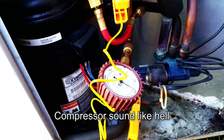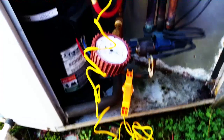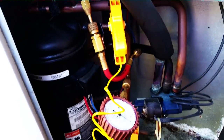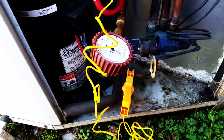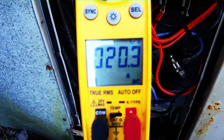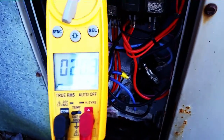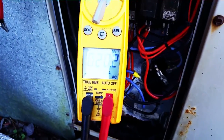Compressor sounds a little rough — probably not long for this world. The clamps are a little bit weak as far as gripping the pipe, but the smaller pipes have a hard time gripping especially with the vibrations from the compressor. We got heat one and heat two came on at the same time — bringing those supplies together, I got 5kW right now. We're going to make sure the other one comes on and if it doesn't, we're going to find out why.